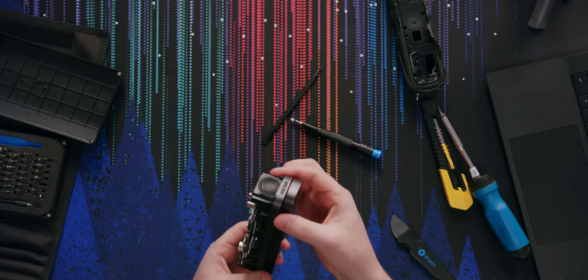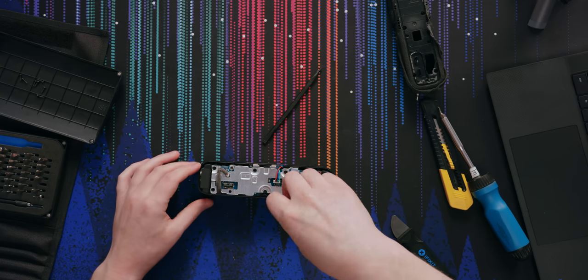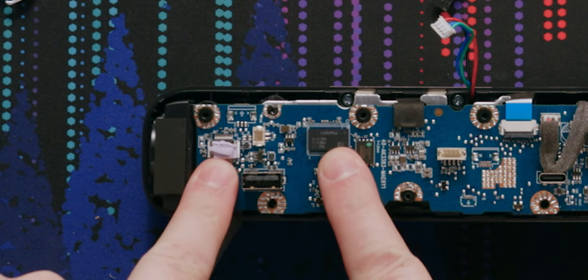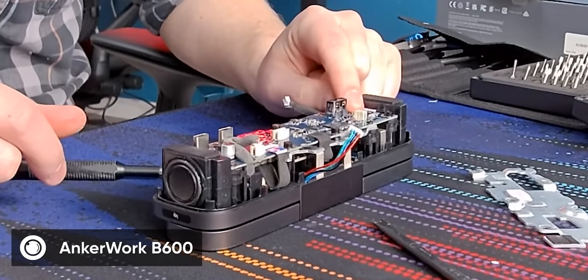There are our speakers — packaged on either end, firing outwards, which is kind of strange, but where else are you going to put them? There's a little metal shield here, probably just for EMI compliance — making sure this doesn't put out random electromagnetic radiation and doesn't accept it either. This also acts as a little heat spreader, cooling these two chips right here. This one right here is a USB interface chip, and the other one probably does power management. We didn't need to cut the mesh — that was just unfortunate.